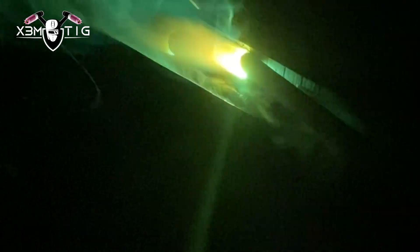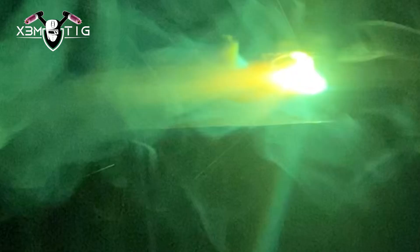On the backing plate there's a little window on all four sides where you can have slightly uneven beads or small mistakes on the corners, because those corners are going to be cut. Three strips will be cut from that plate for the bend test, so the corners won't be used.